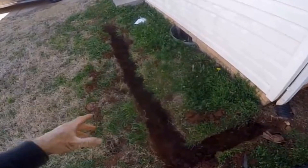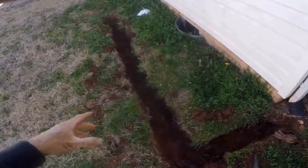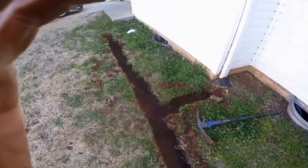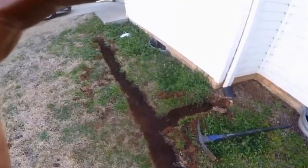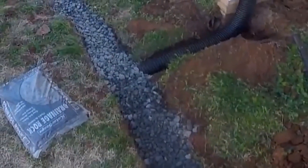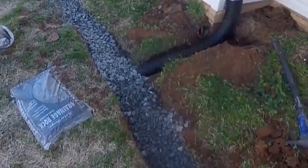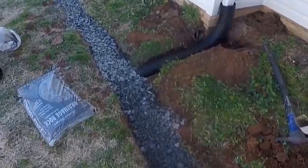And the downspout drain — same thing. Do not run this downspout drain along the foundation of your home. If you're installing a gravel perforated pipe system or a trench drain trying to solve a basement problem, you must be down at the footer level. If you only put it a few feet deep, whether you discharge to a sump pump or gravity, you're going to create more problems.